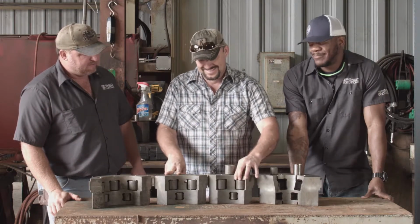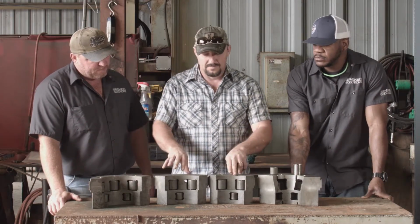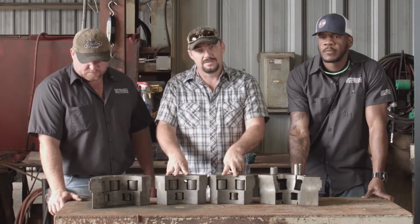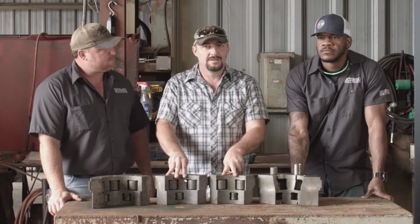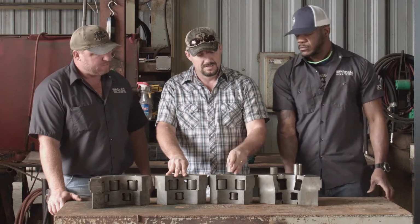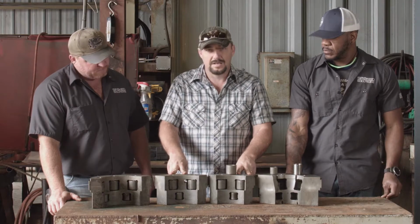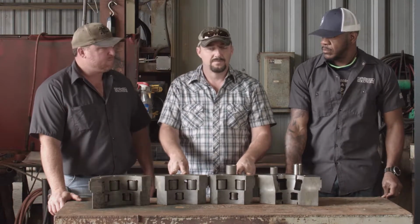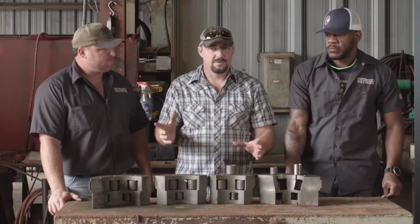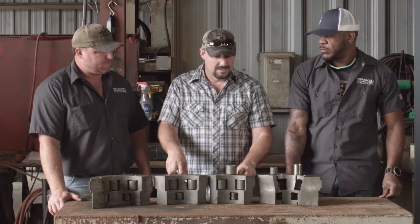They can come in a beveled or a straight. We can fit these to essentially any connection: the 18 degree, 12 degree, or 5 degree beveled, or a collar TNC connection. We can match any size tubing from 2 3/8 up to large size casings. Actually, probably up to 30-inch casings.